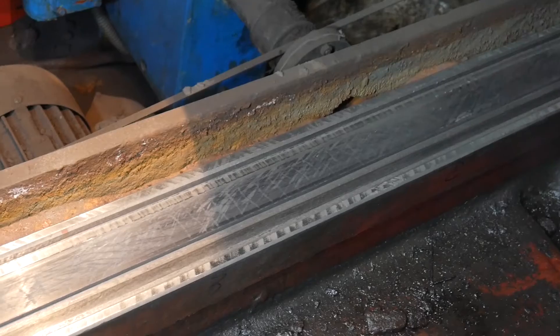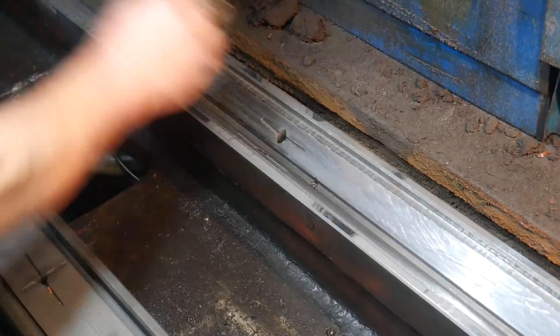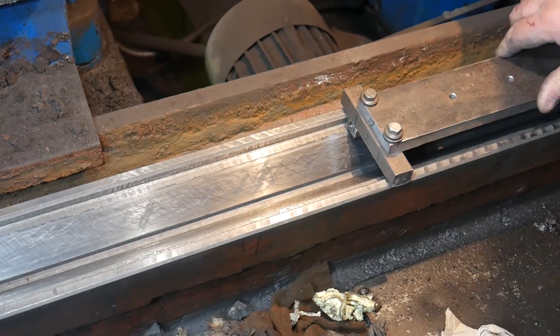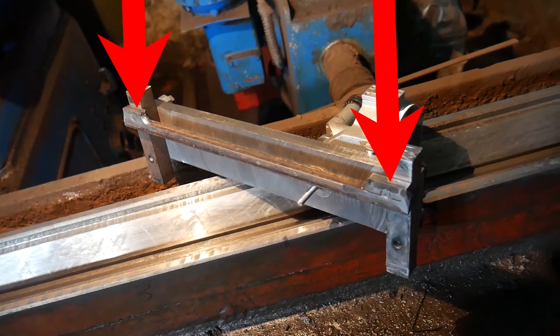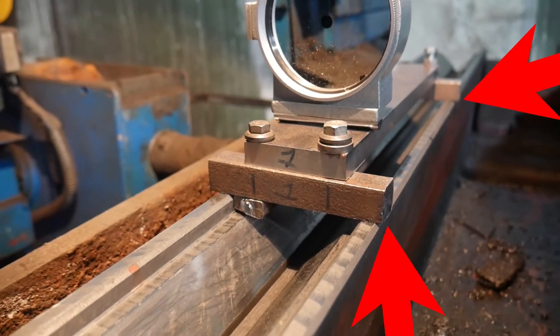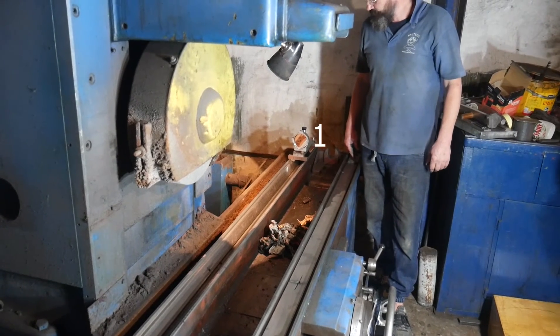I am cleaning the second reference line, removing dust and abrasive. For this measurement, a stand for the autocollimator mirror has been made with suitable reference points. There are four for the horizontal plane and two for one of the vertical planes. The mirror step movement is 300 millimeters, with a total of 10 steps.